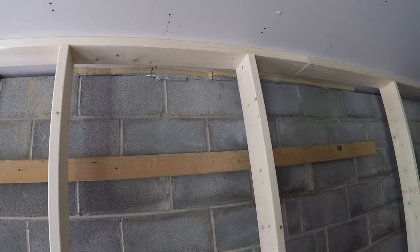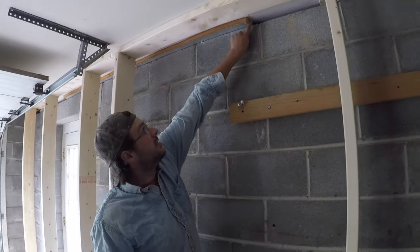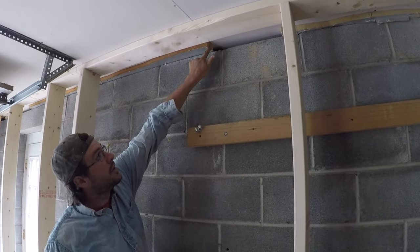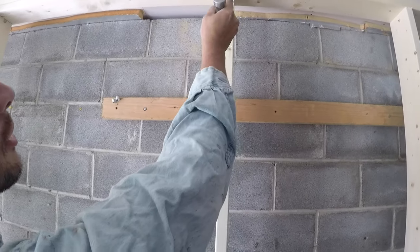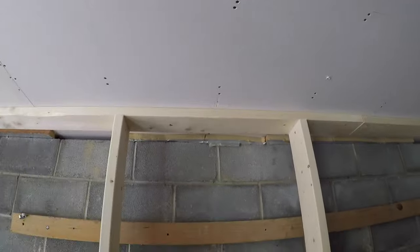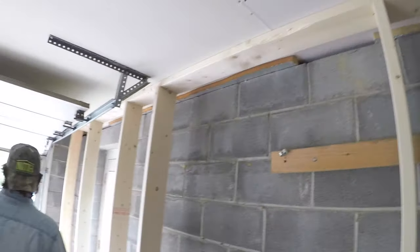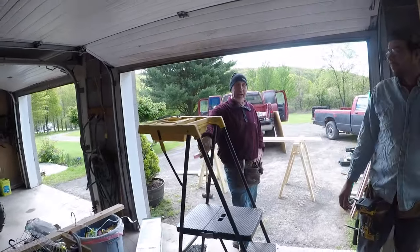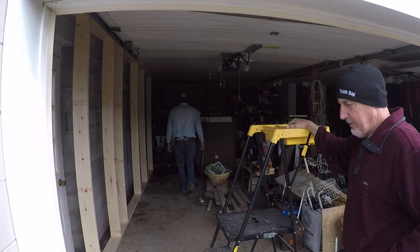Just the sill is going to be treated — there's no reason to treat anything else, just the sill. The reason this happened in the first place was improper deck flashing. So we basically take these two-by-sixes and build a wall. Each one of these studs is about a quarter inch more. When we first started you couldn't move the insulation they packed in, but you add a quarter to three-eighths of an inch and you can jack the house up. You want to make sure each stud is underneath a joist. There's sheetrock there but we can tell where all the joists are because of the screws and the lines where they attached the sheetrock. Another benefit of doing it this way is not over-jacking — you have windows and doors on that wall, and you'd wind up with cracked sheetrock and more repairs.